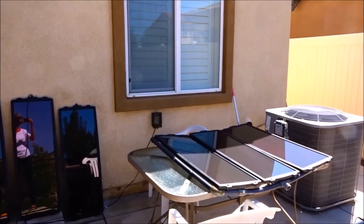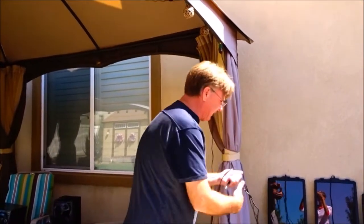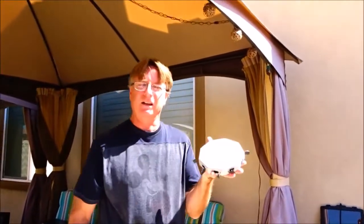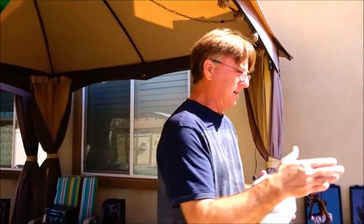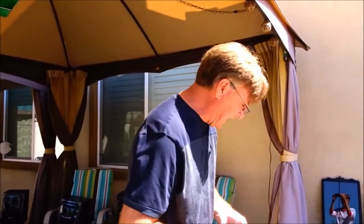I have three 15-watt solar panels for a total of 45 watts that I'll put into the harness that comes with the kit, giving me a maximum of 45 watts from that group. Then I have another group of three 15-watt panels as well. The reason I'm bundling them together is that this hub has eight input points and I already have nine solar panels. The hub handles 400 watts, and my total possible maximum is about 190 watts — roughly half of what this hub can handle.